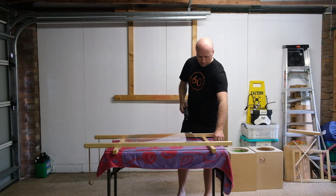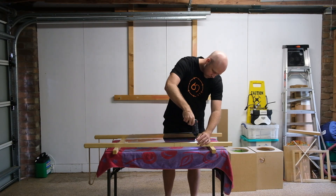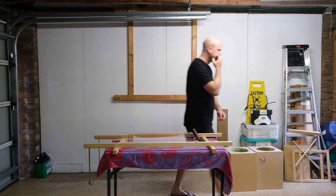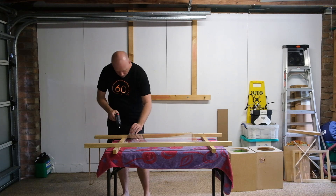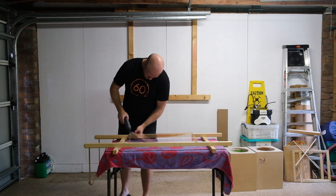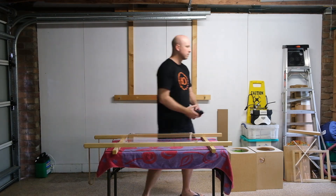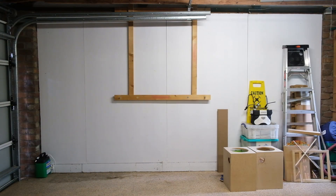To illustrate this, I'll be showing waterfall decay measurements alongside the usual frequency response measurements. Those who've seen my previous build videos might notice that these frequency response graphs look a lot better — I have you guys to thank. Several commenters recommended I learn to use gating in my measurements. Gating essentially removes the response caused by room reflections or sources other than the original speaker. Well-equipped speaker designers use anechoic chambers, but most of us settle for this digital version. I found the optimal settings and the results are much flatter and more in line with how they actually sound.